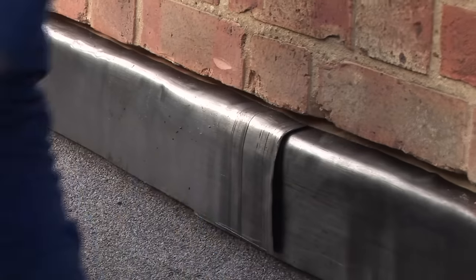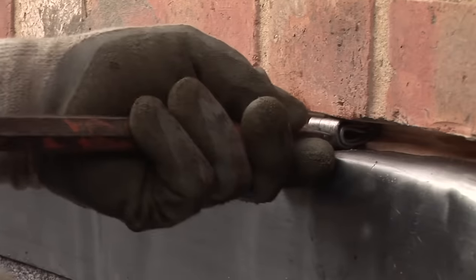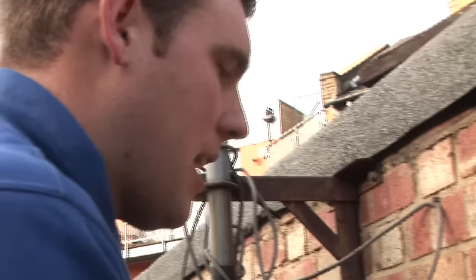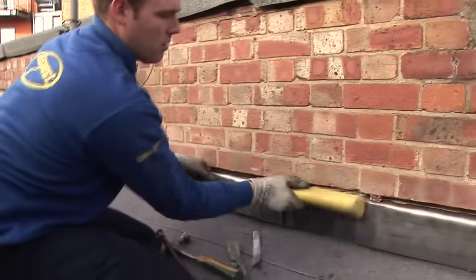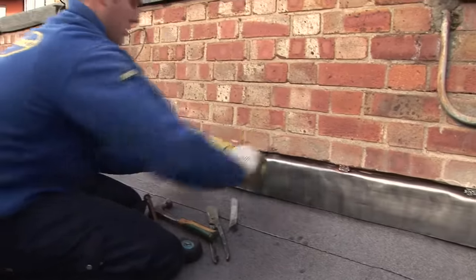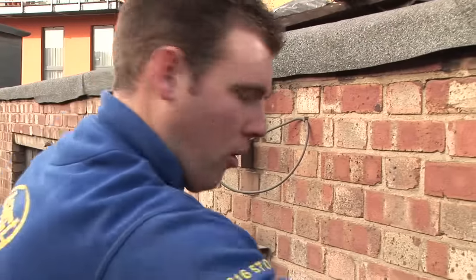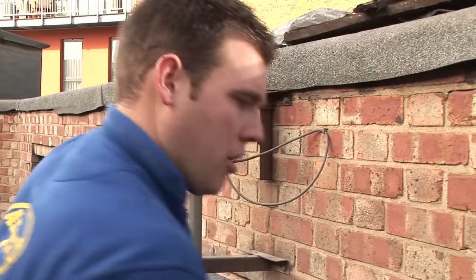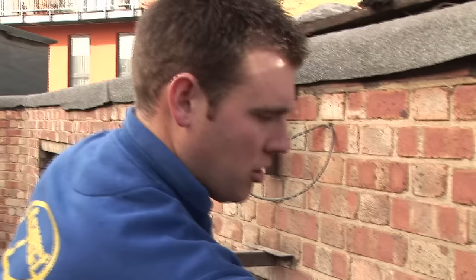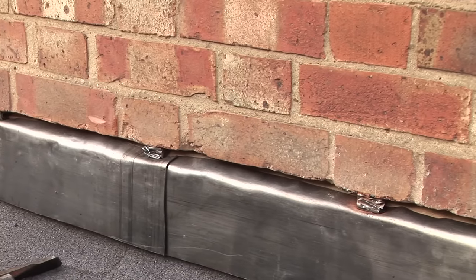So it's very important to make sure you've got about a six-inch overlap of the lead. You can continue putting lead bungs in the chase — the more bungs you put in, the better and stronger it becomes. Use a lead dresser to dress the lead into the wall so it becomes a lot tighter. Once you've put all the bungs all the way through, make sure the lead is completely secure. The finishing step will be to point in the gap right along to make it as watertight as possible.